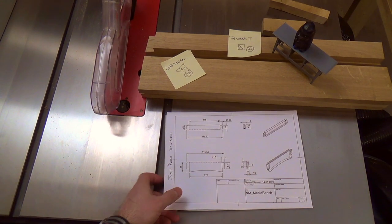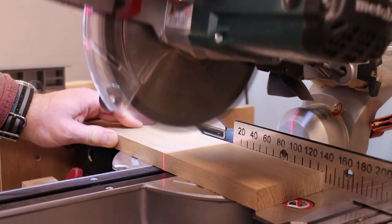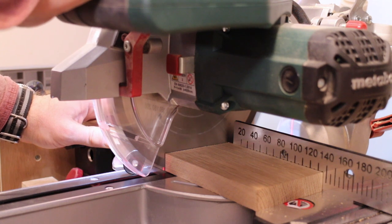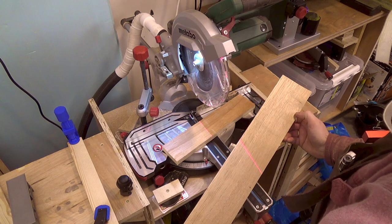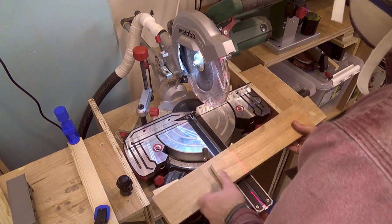The aim for today is making the tenons and dry fitting the sides and the back. Cutting the parts closer to their final length on the miter saw, I used a template to assess the grain pattern before making the cuts.